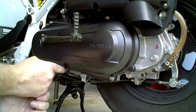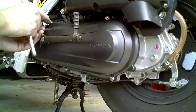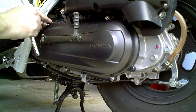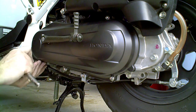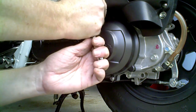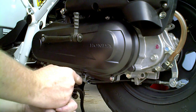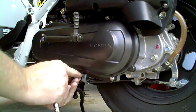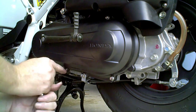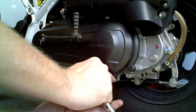I'm going to use a cross-tight pattern. As you tighten one side, the other side will kind of loosen up. You don't want to get one side completely tight and leave the other side completely loose — that's when you get leaks. Not to mention it kind of torques your case and can conceivably cause something to break. The main thing is to make sure the seal sits properly by tightening things down back and forth. Now I'm just going through making sure that I actually got all of them.